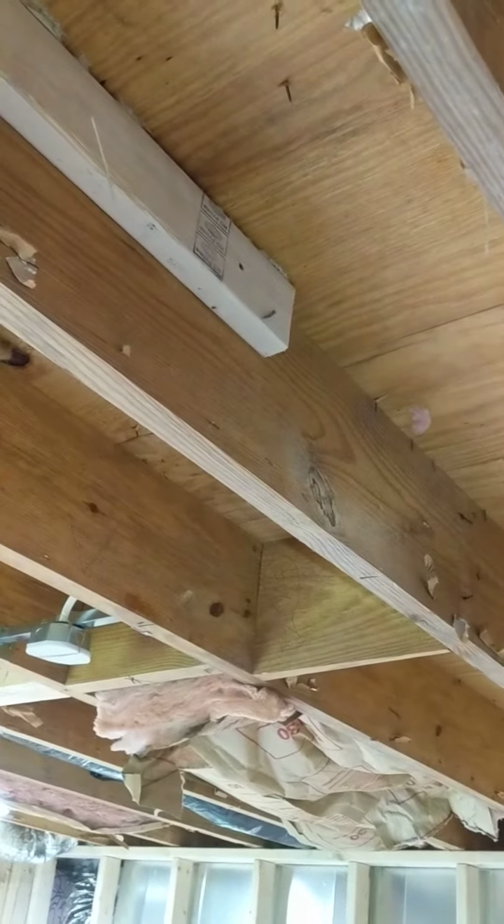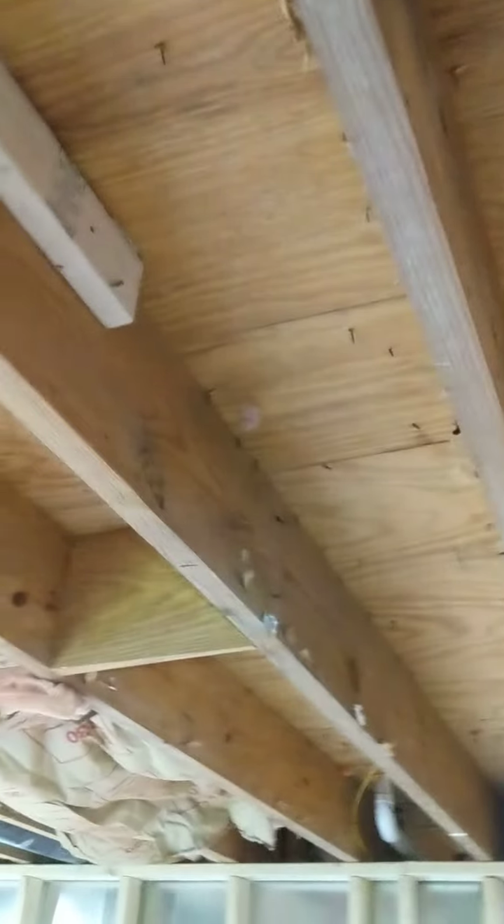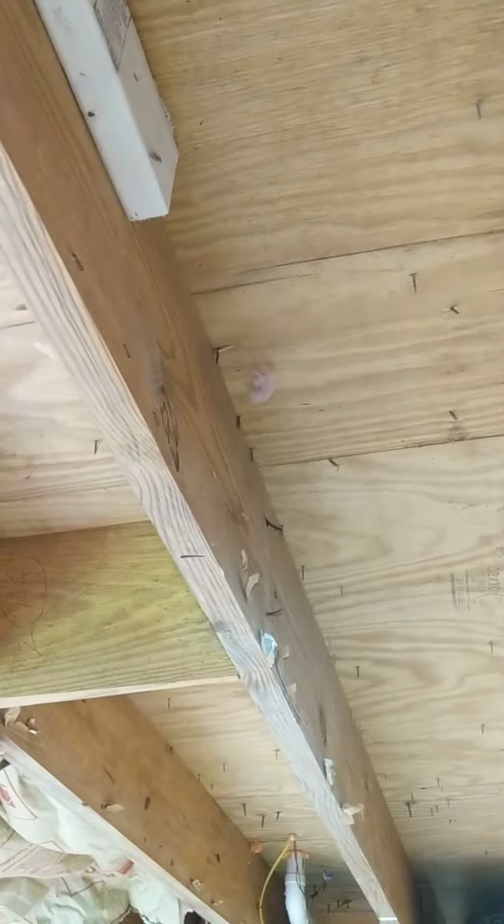In this video, we'll be talking about how to find and kill those annoying floor squeaks. We're down in a basement doing a remodel in a house, and my coworker here is squeak hunting up above the joists. Super quick explanation is that the subfloor here in this older house is not nailed tightly to here. The nails work, but you'll see they miss some nails, and no matter what, the floor bows and leaves a little space.